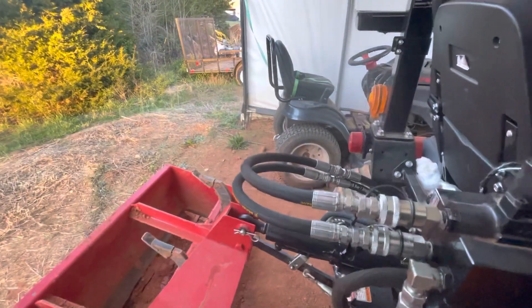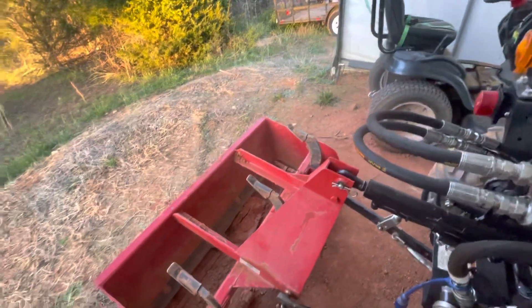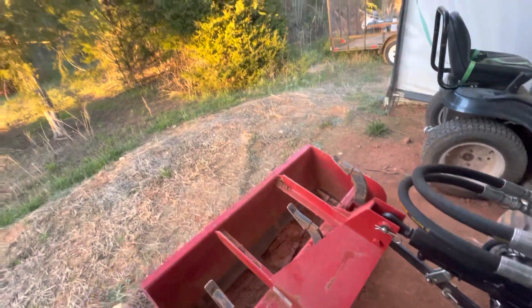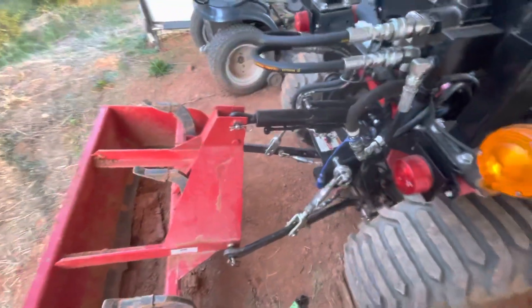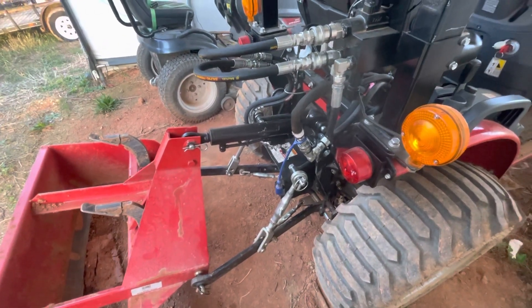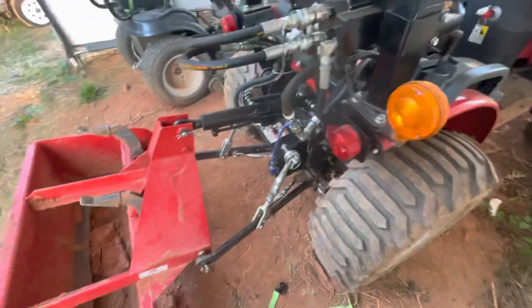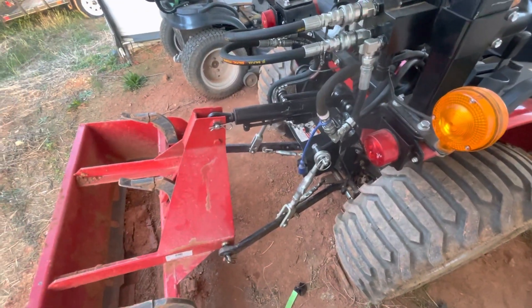It's really easy to adjust this from the seat to go from cutting to smoothing, to pulling material, to leveling out — then backing up and leveling while keeping that blade up so it doesn't dig in. You really don't want to dig in on a three-point hitch on a small tractor like this; it's just not really designed for that. But it'll pull until it doesn't have enough traction, so you have to feather that blade out to make it acceptable for the tractor.